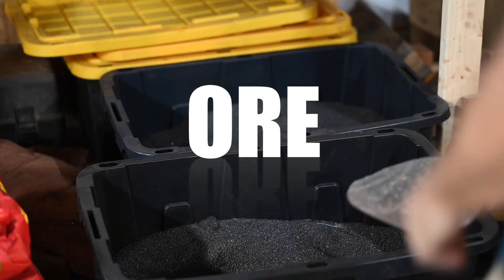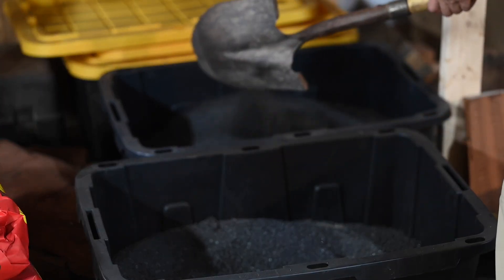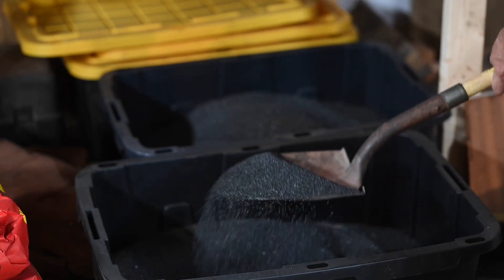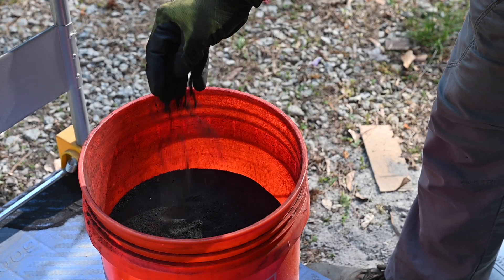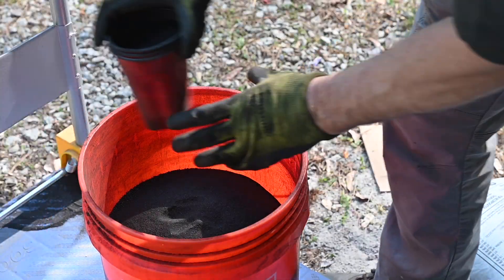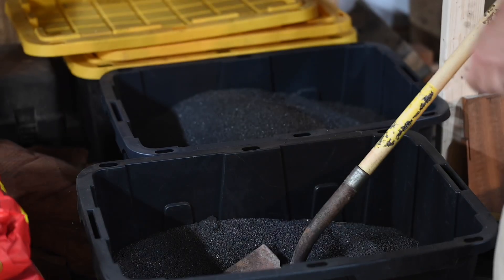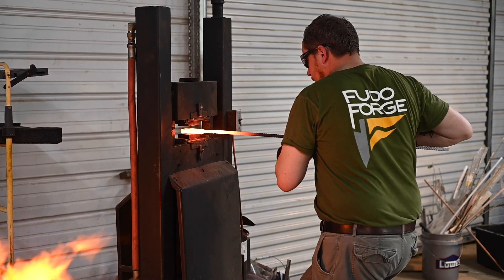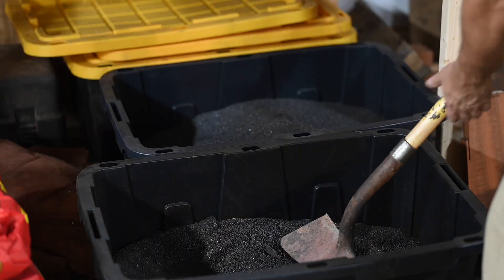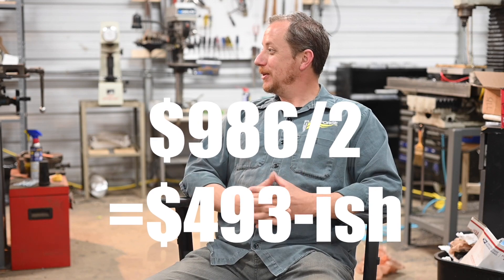The next hurdle is your ore source — quite a variety of possibilities. Over the years I've used various hematite and magnetite-based pottery glaze media, specular hematite from Canada, taconite from Minnesota. This stuff here is a magnetite ore from Pennsylvania, which my friend Eric Orris tracked down in one-ton quantity through contacts he has in the steel business. We paid a grand for it including shipping, plus there was a lot of driving on Eric's part — this wasn't just something you order off Amazon.